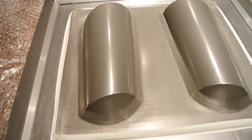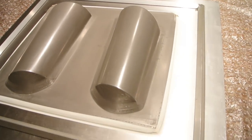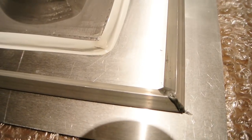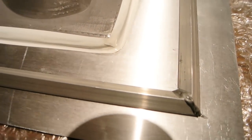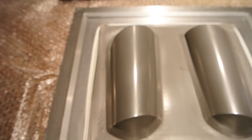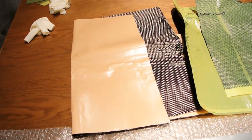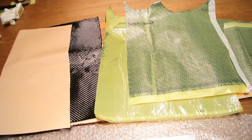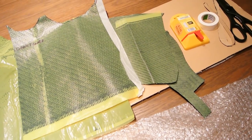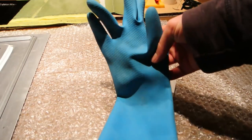For the complex molds, you can see the flange on the top — this will be a gutter going all around just to have the silicone fit into it, so you don't need any tacky tape or anything to close those molds for vacuum. The setup is almost the same: I use a finishing layer, then a 400 as a backing layer for stiffness, and then some 200 leftovers to add on those tight flanges.